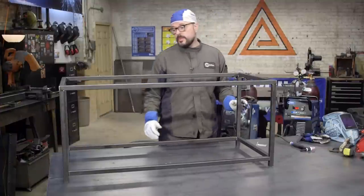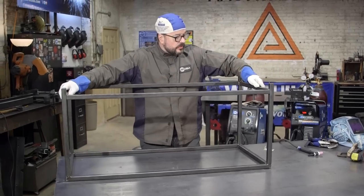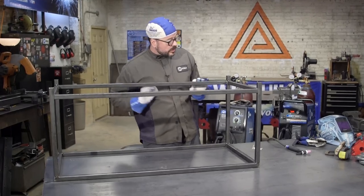I start hot and then gradually take my foot off the pedal as I'm welding, but that's a personal preference — a lot of people go right to 75 and maintain that the entire time. So we're going to flip this over and do the interior underneath on the supports first, welding in a cross pattern. So we'll get going.